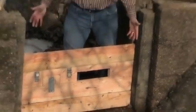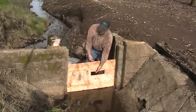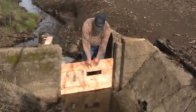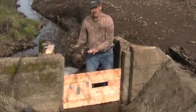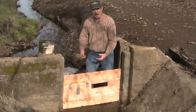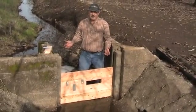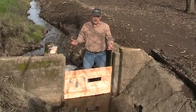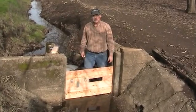So it's easy to see you can have any size of orifice that's convenient. In this case, I have enough wood on top to develop some head so I can get considerable flow through that orifice. If the orifice is down low where it's submerged downstream, then it's a submerged orifice. If it's up higher where it can be free flowing, then it's a free flowing orifice — a little more water gets through there and it's a different equation. And that's pretty much it. Later on, we'll show how to operate this all with the flow actually going in the ditch. Thank you very much.